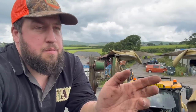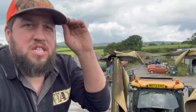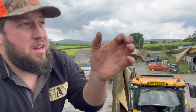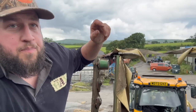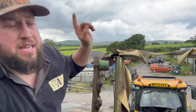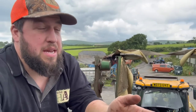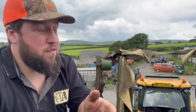Ty asked the question, why not put it over 2 tines, wouldn't 2 tines be stronger? Well, pallet fork tines are more than strong enough to lift the mower by a mile. But if you put it over 2, there's a risk of them sliding, so they can actually slide across, and then you've got less control over a situation that you've already got not a lot of control in. By having it on a single pivot, the weight of the machine should dig into the belt or the strap, as I've got on there, and you've got that singular pivot point, meaning you've got a single point of control, not a double point of control, which with physics is better. It's the same thing as a fertiliser bag, it suspends off 1 bit. If you go into 1 fertiliser bag with it spread, it's got room to roll and move. So that's the point, and then do everything really slowly, like really, really slowly.